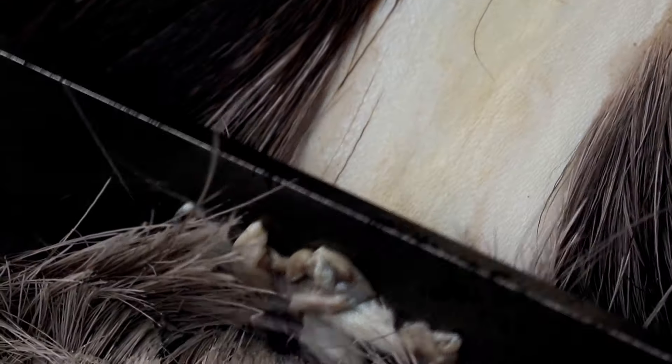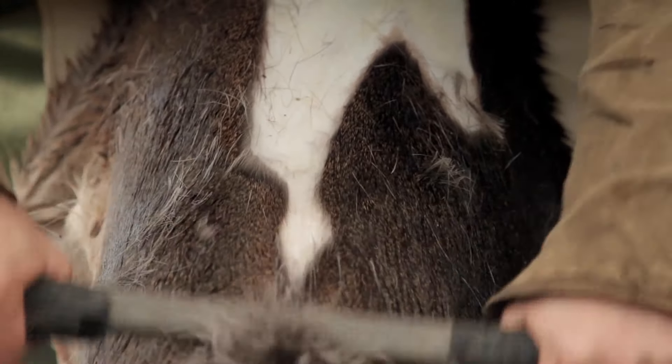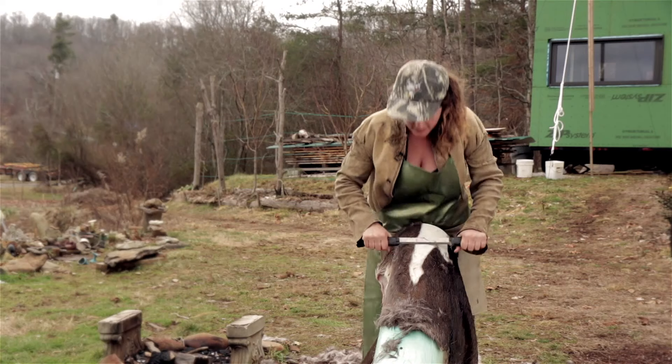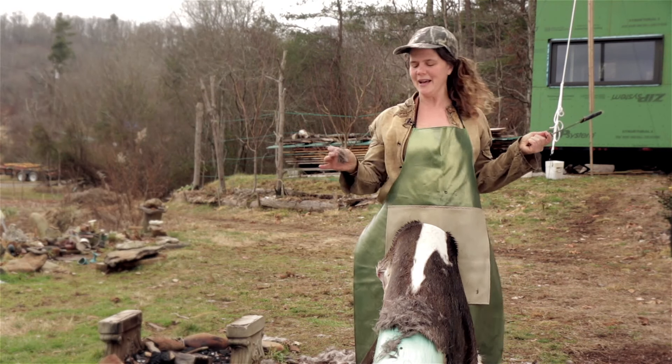My strokes are like mowing a lawn — here, then here, then here. My strokes may be long because I've done this so much, but yours should be really short. It's important that you don't keep going past where you are removing grain, because you will just be wasting your energy. It is very easy to remove hair without removing grain. You can tell there's still grain if it feels a little shiny to the touch, or if you scrape and get material off. The surest way to know you've removed all the grain is that nothing else will come off.